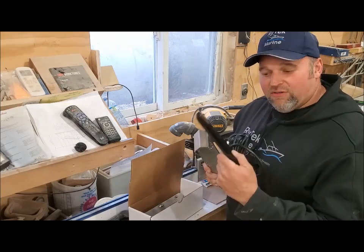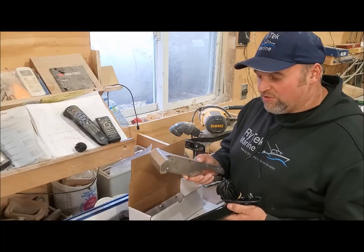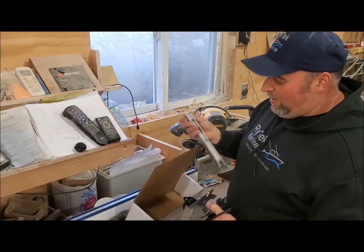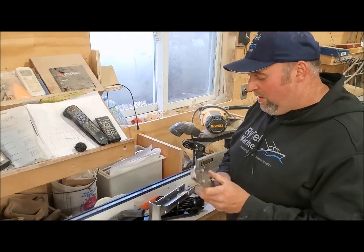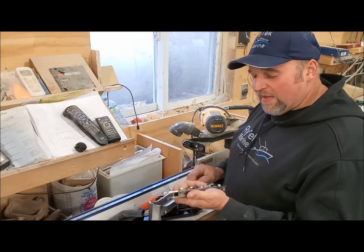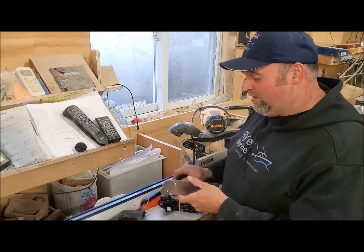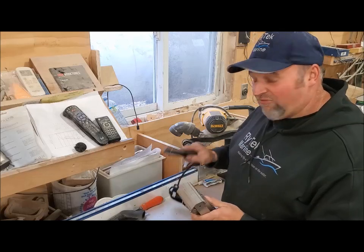So basically you have your Hook triple shot transducer, you get one of my 3-in-1 mounts that works with any of the Lowrance StructureScan transducers, other than the short little LSS one that's pretty old by now. You get one of my current trolling motor brackets, and then you also purchase the auxiliary bracket — this is the RTL 4500. What's going to happen is you're going to modify the triple shot transducer to have this mount glued permanently to it, and then the two mounts basically mate together. So then you're going to have a fully guarded triple shot mount.